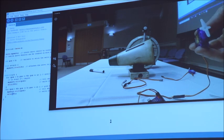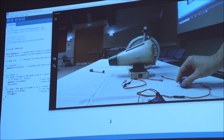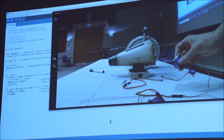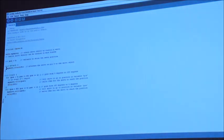Like on the Arduino boards. Sorry? I've got Arduino boards, and they've got like 10 servos. Yes. So I do that 10 times for each servo. If you look at this code, the servo library is calling something my servo. My servo is that servo. If you've got another one on it, you'd have to call it something else. We'll call it your servo. And then you might have servo 1, 2, 3, 4, and Lawrence's servo, so about 3 servos with different names.